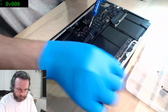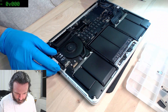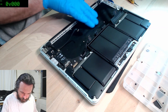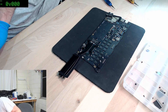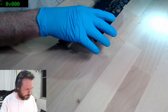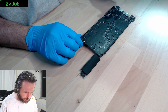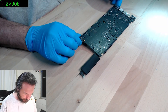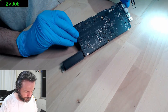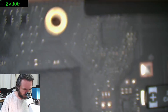The 1502 fan is a bit of a pain in the butt, I will definitely grant you that, but still no reason to actually tear it in half. Can't see any corrosion marks there. However, it could be in for a bit of a mystery. Let's flip it over and have a look. Now on first impressions under the lighting there's a bit of a haze in this area here — almost like a wash haze. Let's have a look under the microscope and we can both share.